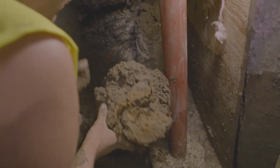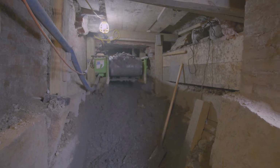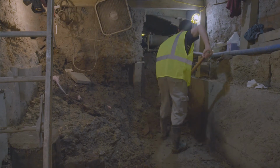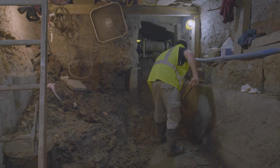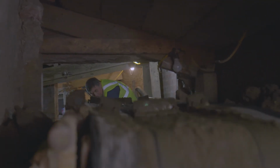And so after you've done that all in one pit that might be 8 feet long along your wall, you'll come out of that pit and you'll move to an adjacent pit next to it. So it's a series of pits working yourself all around the building and at interior columns or walls, one by one, and then eventually you have a whole new foundation that's dropped the wood piles below the groundwater table.